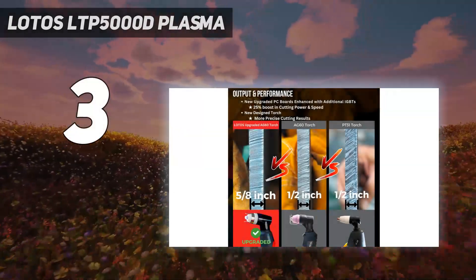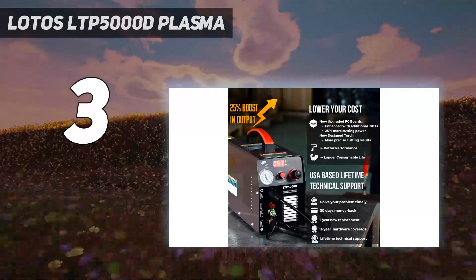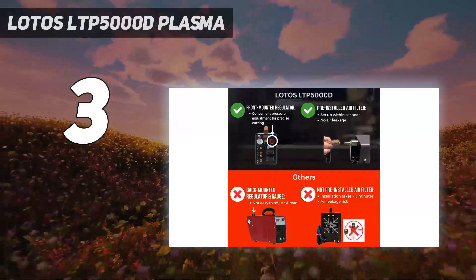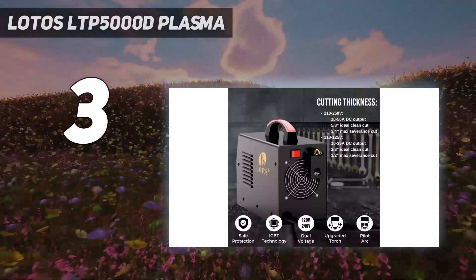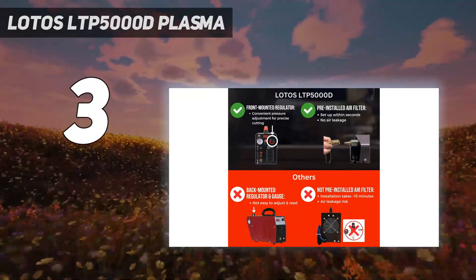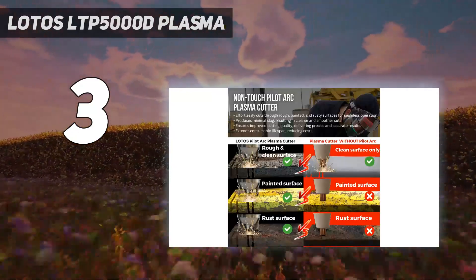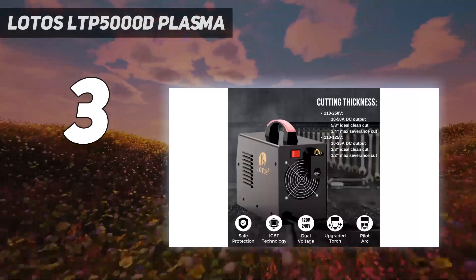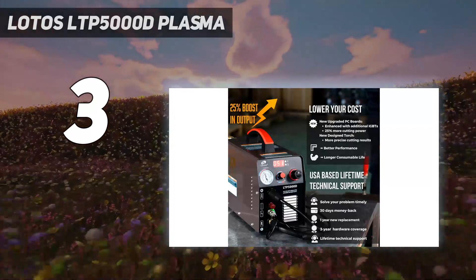At number 3: the Lotos LTP5000D Plasma Cutter. We really like the Lotos LTP5000D 50-amp machine. It doesn't come with the same quality as the Hobart Air Force 40i or the Hypertherm PowerMax 30 XP, but it's one of the best 110V-220V plasma cutters for the money. With a 10-50 amp cutting range and a non-touch pilot arc that severs clean cuts through rusty or painted metal up to 1/2 inch thick — and even thicker if you don't mind a slower, rougher cut — it's impressive. The drag technology is excellent for tracing lines, keeping the nozzle clean and making starting the plasma slice easy while continuing a consistent, effective cut. We highly recommend this to any hobbyist needing to cut no more than half-inch plate, though it's a little light in cutting power for heavy workshop use.